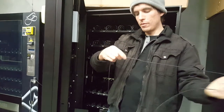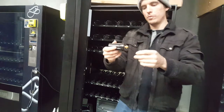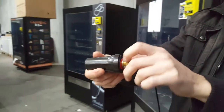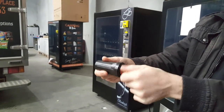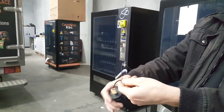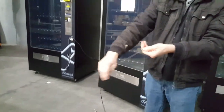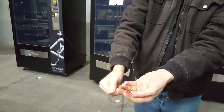First, you'll need to unravel all of your cables so it is straight. Then you'll need to remove the nut, the silver washer and the red washer from the base of the antenna. Simply unscrew the nut and both washers will slide down the cable. Once you reach the other end of the cable, you can feed the connector through the nut and both washers to remove them.